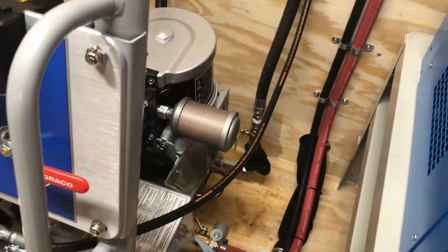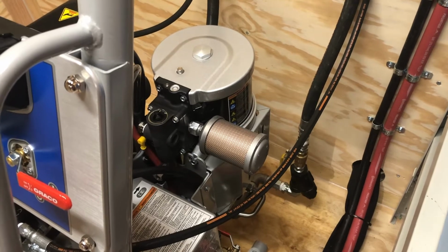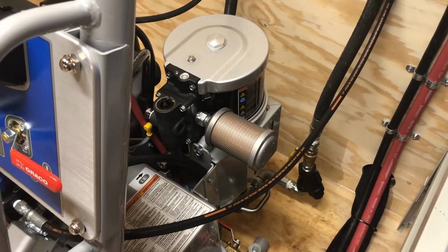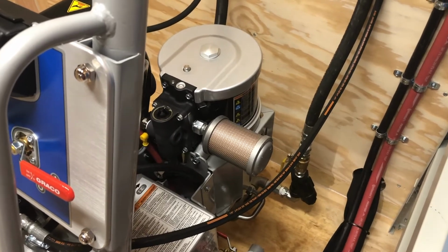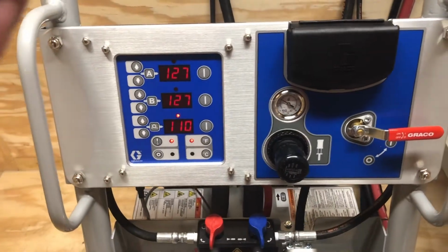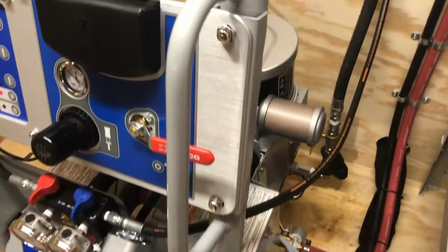The A side, like we covered, is moisture sensitive. If it's parked in the up position, that means that the A side shaft is out in the atmosphere, in the air. Because a seal on a shaft is not a perfect seal, you're still going to get some residual. If you park it in the up position, that isocyanate, the A side, is going to crystallize on the shaft. And the first time you run the shaft down, it's going to rip the seal. So the most important thing we're going to cover is how to park this machine.